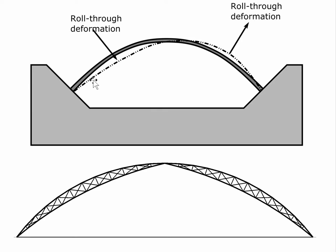In the roll-through process, bending is induced: as the arch flattens, it develops tension on the underside and compression on the top; as it bulges outward, the curvature tightens with tension on top and compression on the bottom. The moment curve for the arch in that deformed shape looks like a sine wave, with the worst moment here and there, and zero moment at the center. We can respond by building a truss structure that is thickest where bending stress is worst — thickened at the quarter points and minimal at the center — giving us a three-pinned arch.